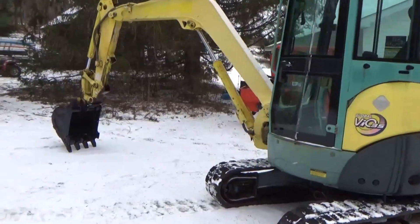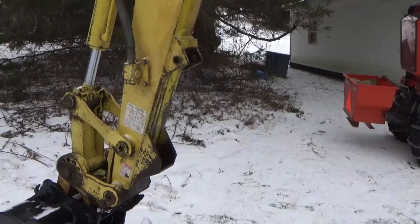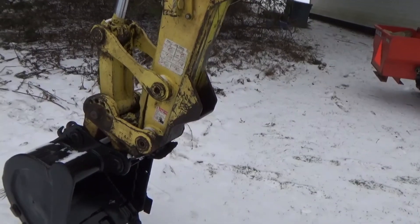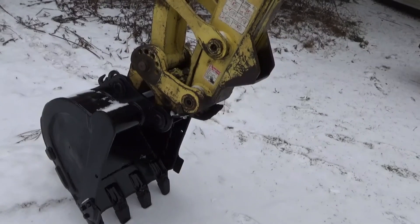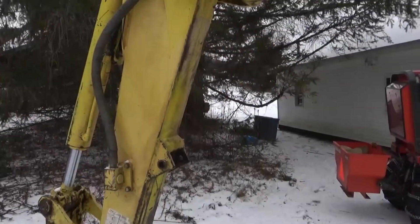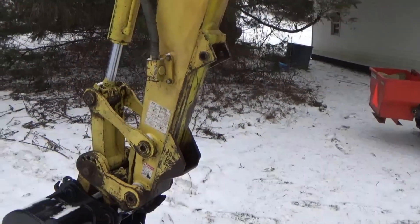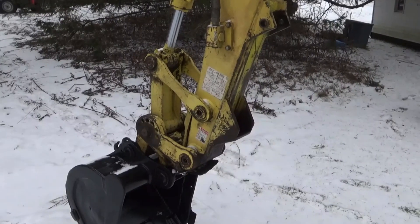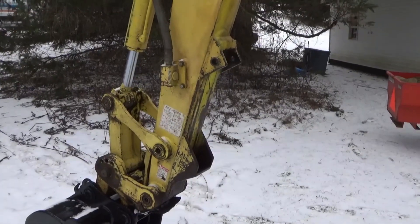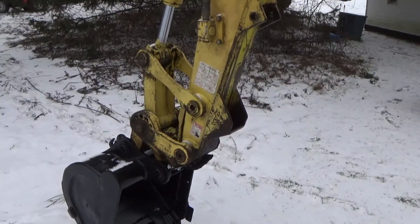This machine was owned by a building contractor who had installed a thumb with attachment points welded directly to the stick. We're going to cut all that off. Our thumb is a pin mount, which is going to go into that pin right there on the stick. It will swivel from there and then the cylinder will come up here — we'll have a weld point somewhere up in here that will retract the thumb when we don't need it. My other machine had a manual thumb — it was great but kind of a pain. It's a hundred-pound piece of steel you're taking on and off, and it gets in the way of the bucket when digging. A hydraulic thumb is much handier.